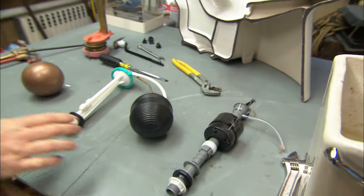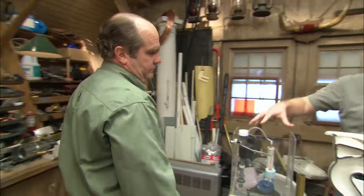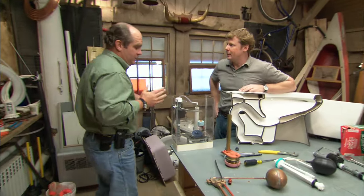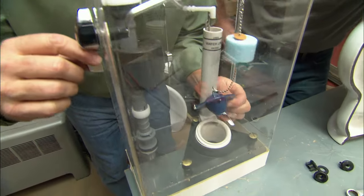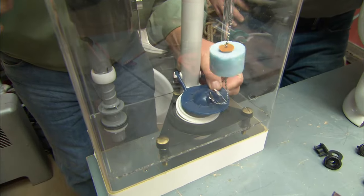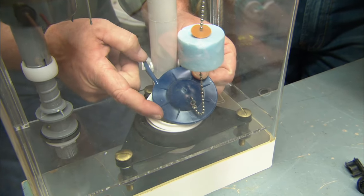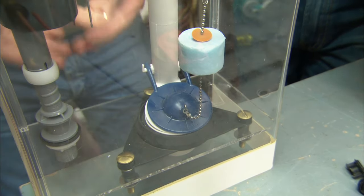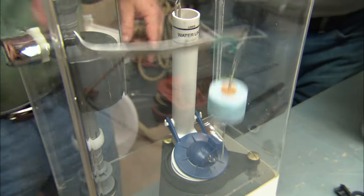Now that we understand the parts, let's talk about leaks. The most common is where the toilet is just constantly running — water coming out of the tank into the bowl over and over. The first place to look is down inside the tank. When you lift that tank lever, the flap is supposed to drop properly. Sometimes it doesn't — imagine it being a little askew. Now the water keeps running; this fill valve just keeps on running and that water goes down into the bowl. Oftentimes people just jiggle the handle, and that fixes it.